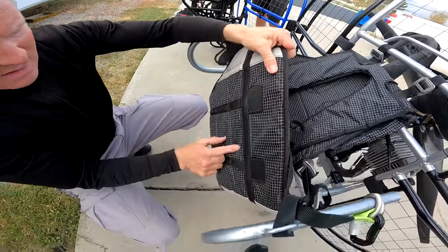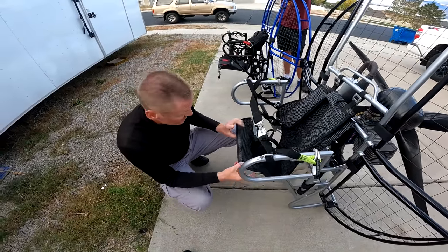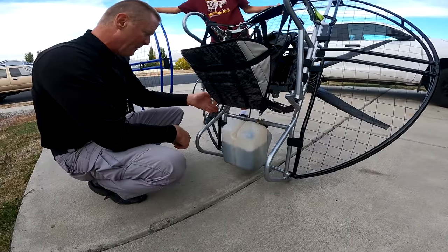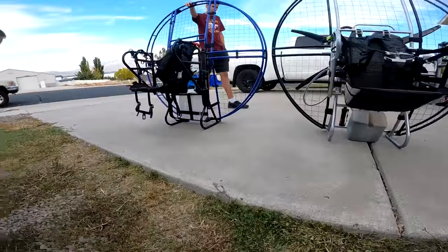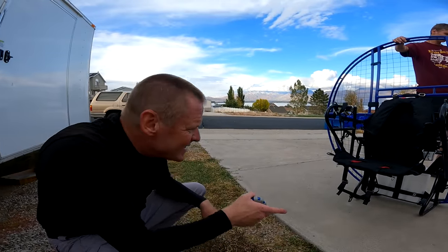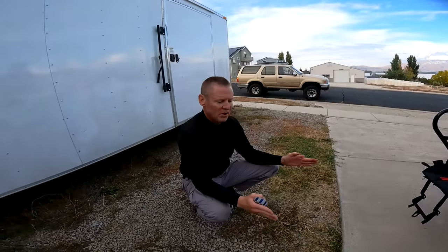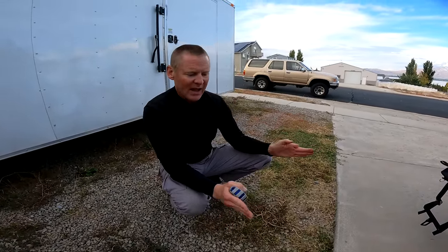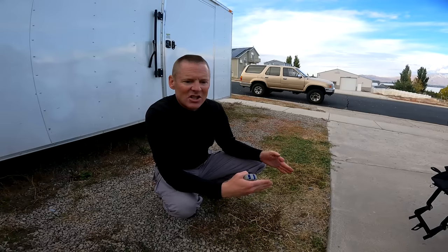There's foam on the bottom of this carbon fiber board — not sure why your board needs foam. The flat top skids are very specifically bent out, over about an inch wider. We played quite a bit with the width of the skids — it's important that they're bent out for more crumple zone. When you fall you're going to hit those skids, and bending them out gives you immediate impact resistance. Without that, you just don't have the distance.